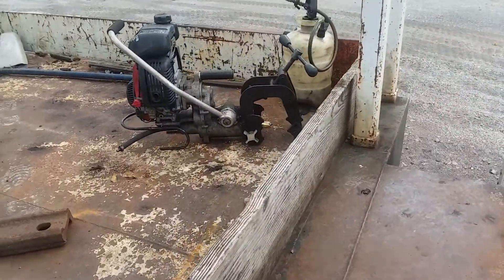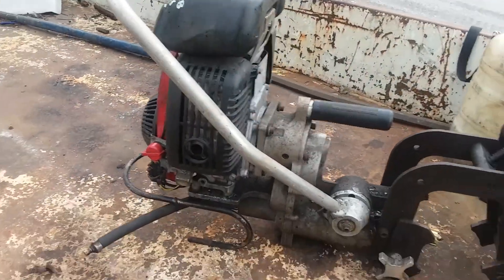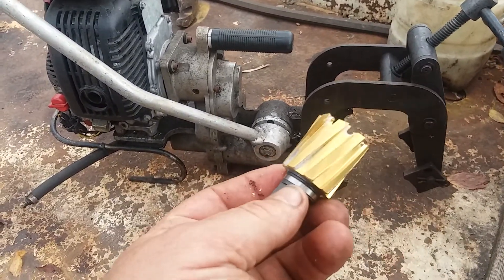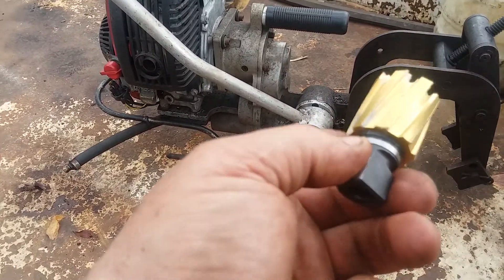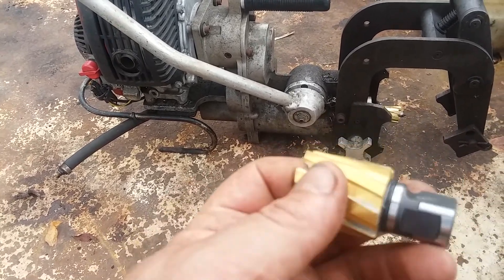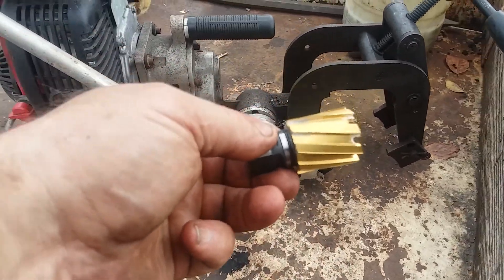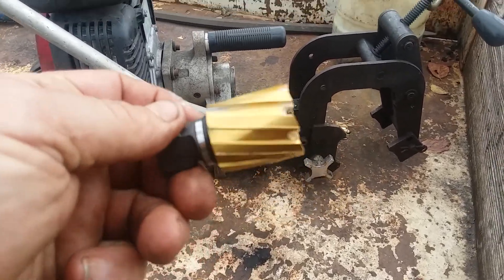Back of my truck there's a rail drill — it does a pretty slick job. Here's a bit: that's a new bit, it's an inch and one-eighth, and it locks in there. These bits cost about 80 bucks apiece, and I can probably drill 15 to 16 holes if I'm lucky with one bit.